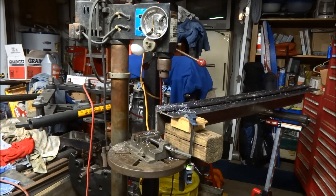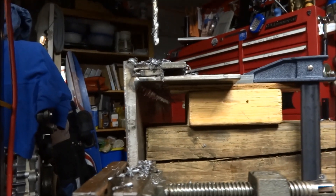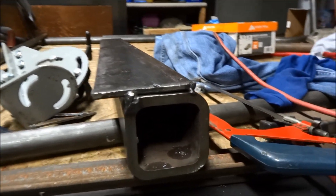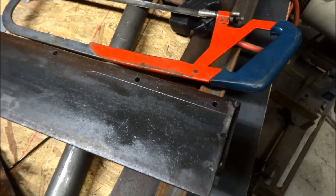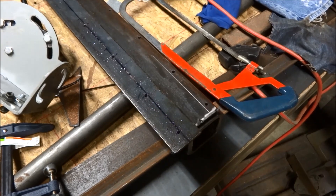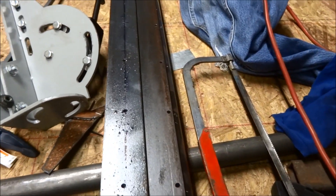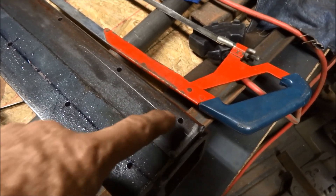That's the last hole in that plate — drilled holes all the way through, all the way down. That's going to get cut into sections for the fingers. This is the back bar, main bar, holes drilled in it — these holes will be tapped. It has a front plate that goes with it. This is the front plate. It was tack welded both ends, then pilot holes and the holes were drilled to the size I'd need to tap them out. The upper plate will get holes drilled out all the way to quarter inch so a bolt will be able to go through and be threaded into this plate.